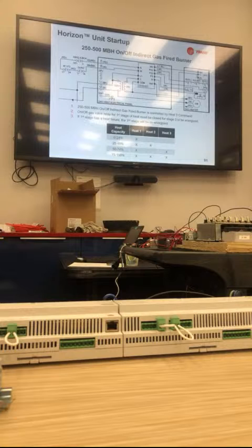And tomorrow we'll go over some of the heat stuff, where we maybe increase or decrease P gains, because we've had issues with these overshooting and undershooting in the field. The dual burner setups are a little tricky. Again, if I have a failure on this side, the modulating, we shut off all heat. It's all gone. Unfortunately, it's just safety. This has the most sophisticated controls, so if something's wrong with it, I just want to kill it all.